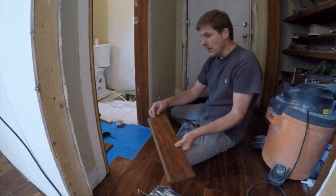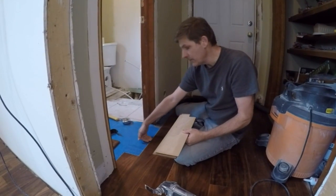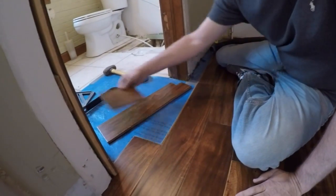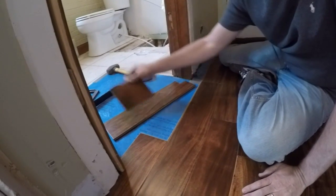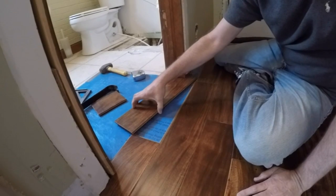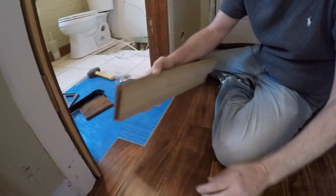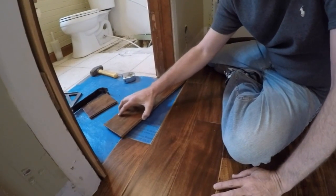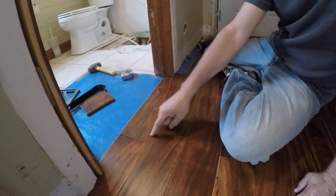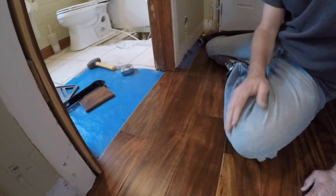So we cut the jamb, we cut our board, we trimmed off the locking portion of this so it's going to slide right in, and then we can just take our board that normally needs to be tipped in and then locked. This one can just slide under the cutout, and then right over here. And on this one, we left that locking one because it'll slide. And then it'll just slide right in there, and boom, done. So I'm gonna pull that back out and put glue in there, slide it in, and it's done, and you have a perfect fit on both sides now.